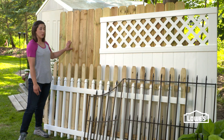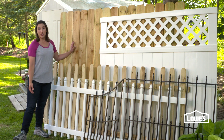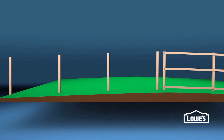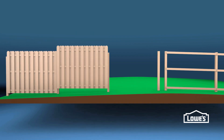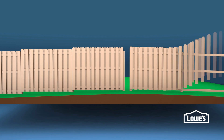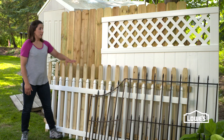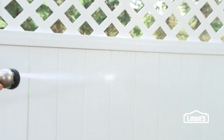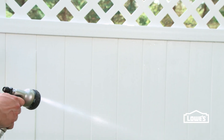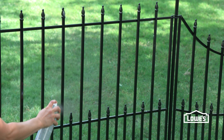These three we have here are your decorative picket style fence. When you're talking about material, wood is obviously the most traditional. It just needs to be stained or painted periodically. It can be put together as a panel system where it steps up the slope of your yard, or as a component system which is board by board and it kind of follows the slope of your yard. Vinyl is a great option — all you have to do is rinse it down and it doesn't rot or fade. Metal is also a great option because all you have to do is spray paint it every so often.